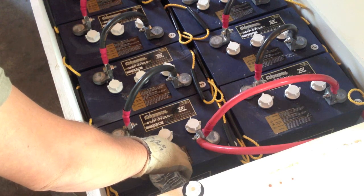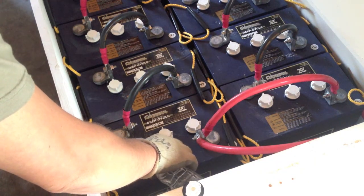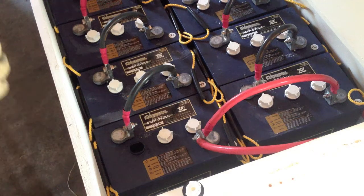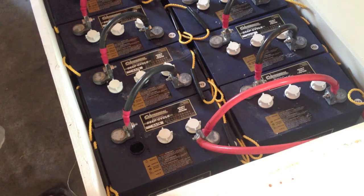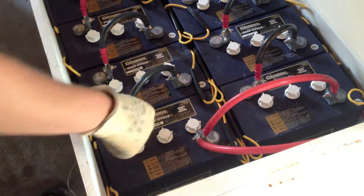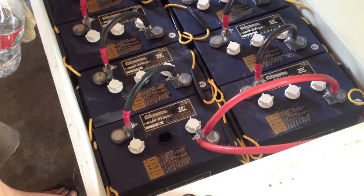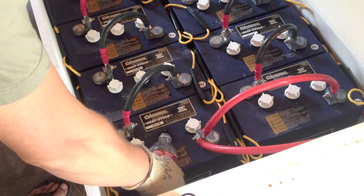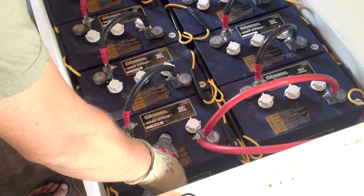Now if you have seen my other videos you'll know that I put something called battery demister oil. That floats on top of the cell water. It stops the sulfuric acid from coming out and basically makes it so only the hydrogen can escape — that's why we vent it through the back. But it stops the damage to the plates if they're exposed to the air from not watering them or not mixing them right.